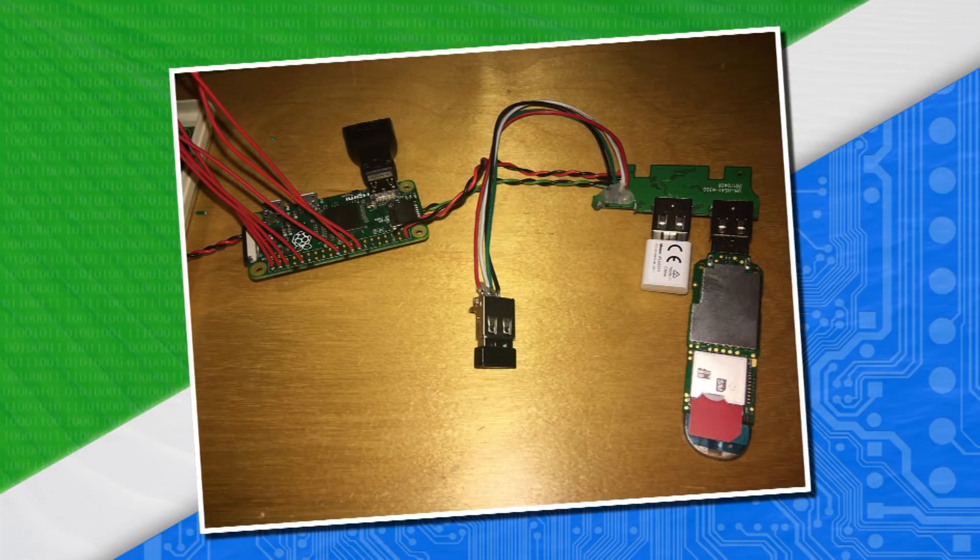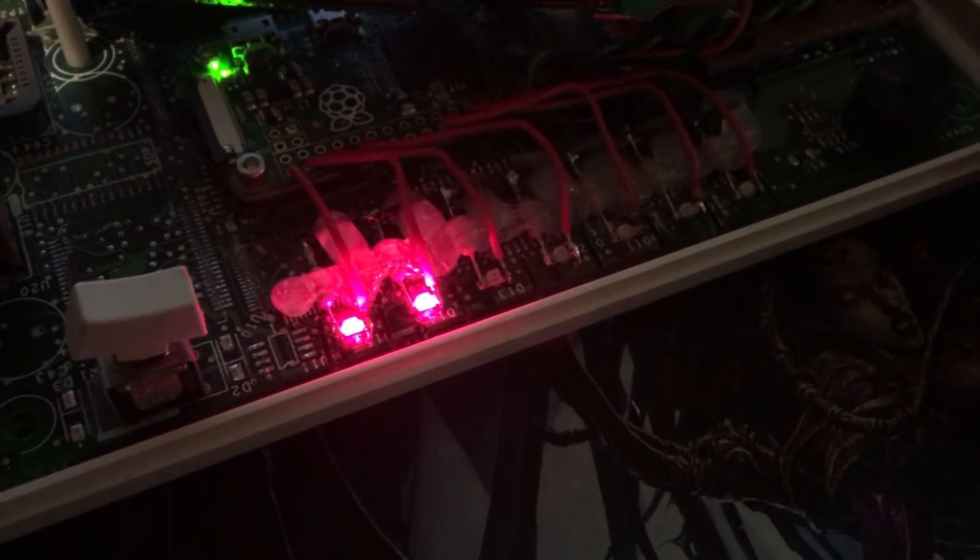The overall build was not too difficult. First, I decided to get the LEDs working, which was a little bit more tricky than I thought because of the design of the original circuit board. I measured the voltage over the LED endpoints, worked out the correct resistor for that, soldered it all into place, and got the lights to actually work and come on as I wanted.